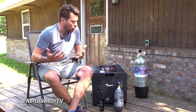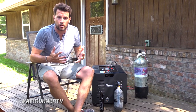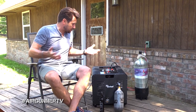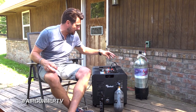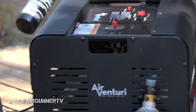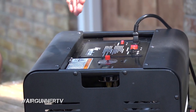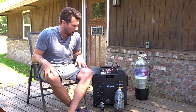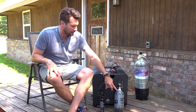You've caught us on a weekend of shooting for American Air Gunner, and we've got a lot of shooting to do. We're going to fill up all the tanks we need, shoot for the next two days, no fire departments, none of that — we just do it ourselves. It's got a cooling system and a pressure gauge where you can set the PSI. For example, if something is only 3000 PSI, you set it to 3000 and when the compressor reaches that it shuts down so it doesn't overfill.